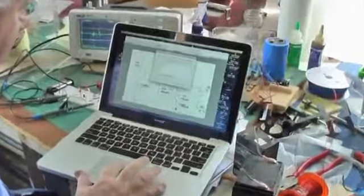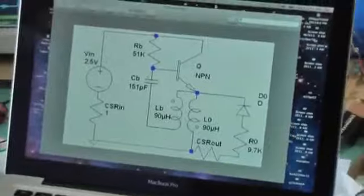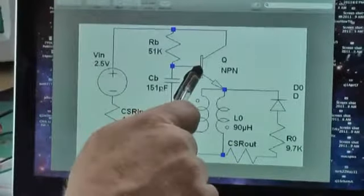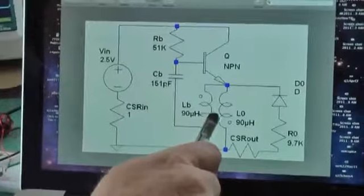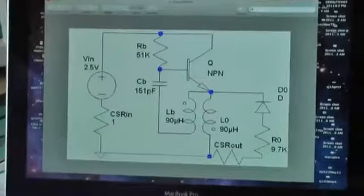This is the circuit that I sent to you — people will have that. I'm hoping people will replicate it; it's a very simple circuit. You've got a small amount of current through a large resistor that hits the base, but most of the gating of the transistor comes from this tank circuit here — the inductor-capacitor. This thing resonates, and that really is what determines the frequency of the entire system.